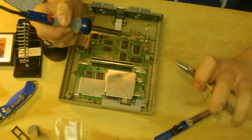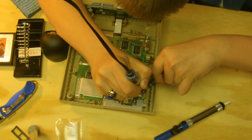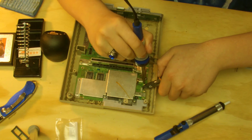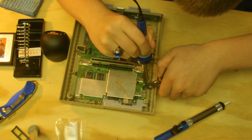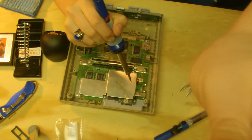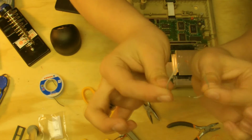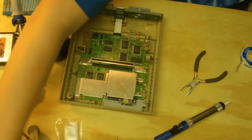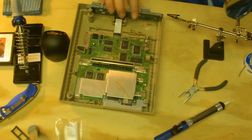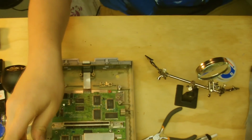I'm actually just going to take some wire snips, or needle nose pliers here, and as the leg of the fuse gets heated up, there is our 1.5 amp Pico fuse that is dead. So, okay, I have my 2 wires that are now stripped. Now we're going to want to tin up the legs of our new wire, and I have a little third hand tool to help me along with that.